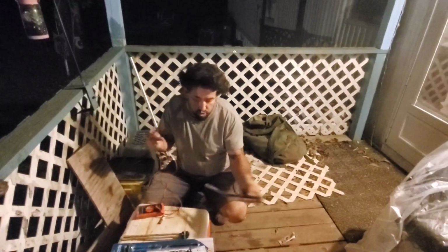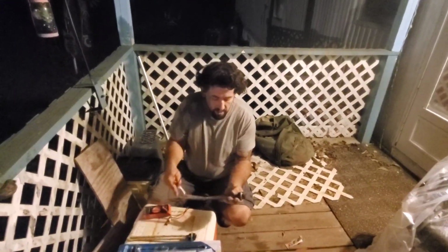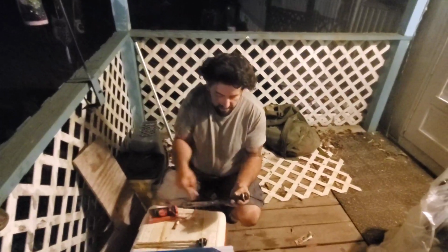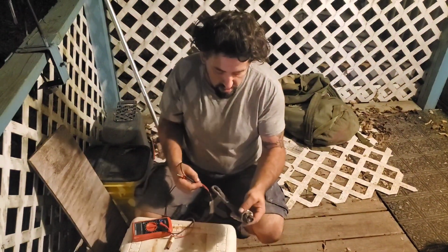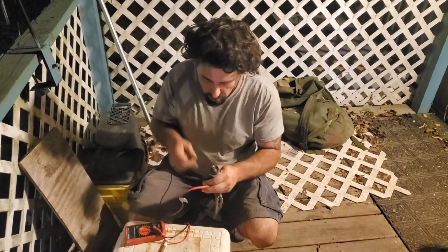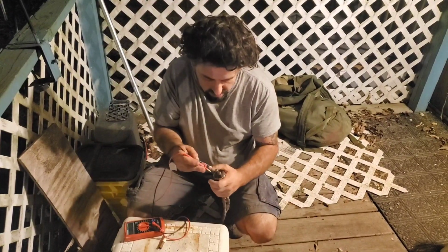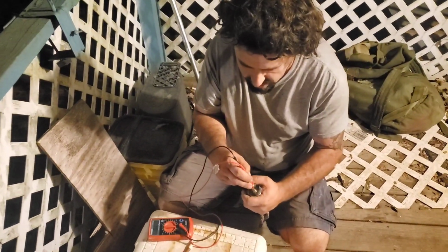So basically what I'm going to show you is, as you can see, this is a continuous circuit, okay? It is continuously connected, and so unless power is supplied, it doesn't work. But there should be continuity, and that's what our ohms is. And so when we touch our 2 posts on this bad element, you're not going to see anything happen. We're not going to get our 13 ohms. You can see it just stays there.